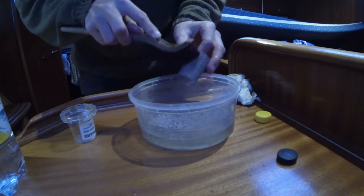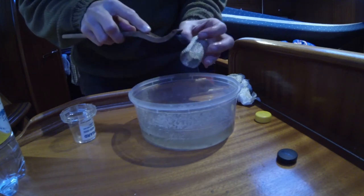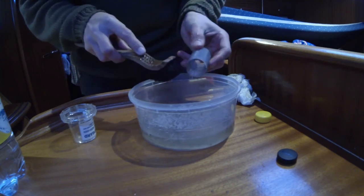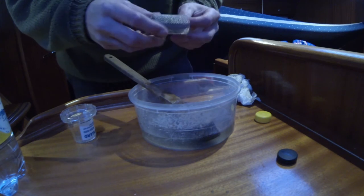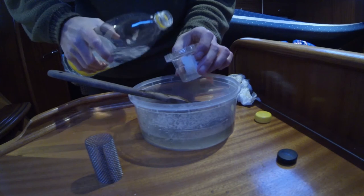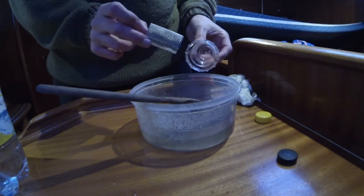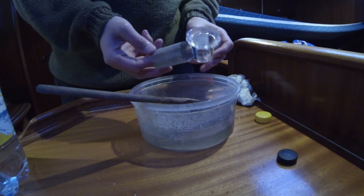The strainer is also designed so you don't damage your pump inside. Inside the pump there is a small rubber membrane that can be destroyed by metal parts and very thick dirt. The pump guard system is now cleaned and as you can see the strainer is totally clean.